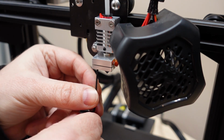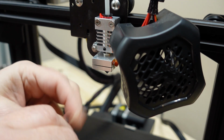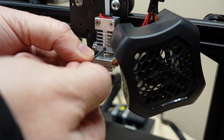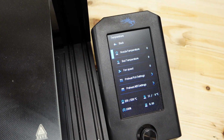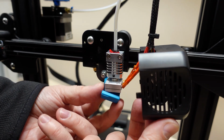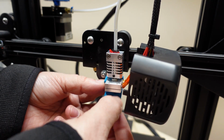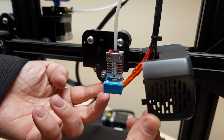It's still a heated nozzle. It's a good opportunity to check the securing screws for the heating cartridge, and also this small securing set screw. Make sure that it is cooled down. Now I can place the silicone cover. So first pop it from the back side, and then the front. This is how it looks.